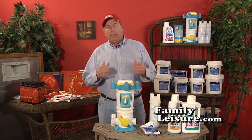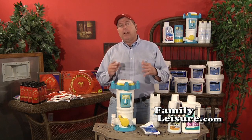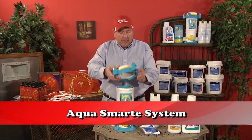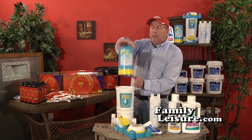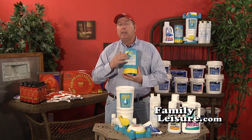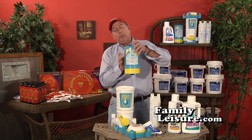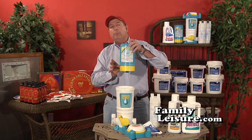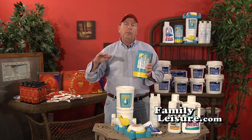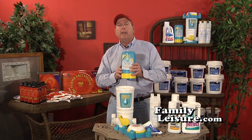For the past 15 years at Family Leisure, our most popular chlorine alternative program is actually a low-chlor system called AquaSmart — it's a natural mineral system. Inside this chamber, there are natural minerals that serve as both an algaecide and a bacteriostat, killing bacteria and algae. As the water flows through the cycler, it flows through these mineral chambers and over those minerals, purifying the water — much the same way as an underground stream running over artesian minerals purifies that stream water.